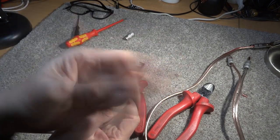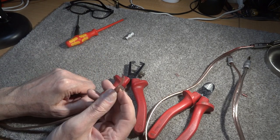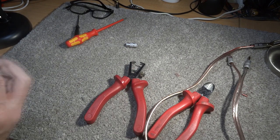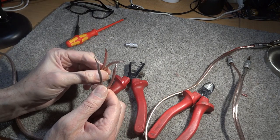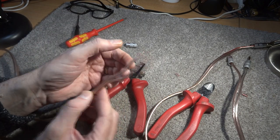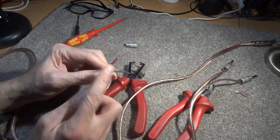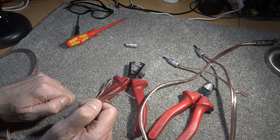Once they're bare, just give them a little twist — and make sure your hands are nice and clean, because you don't want any contamination on the wires at all. Just bare them and spin them around so they'll fit into the connectors. You want them nice and shiny — a gold or bronze colour. What you don't want is dirty wire like I've done on purpose at the other end, where oxides and gunk build up and loosen the connection over time. So try and do it once, get a proper connector on, so when the screw goes in it's a nice clean, great connection.